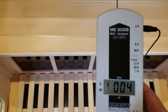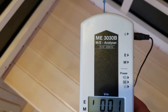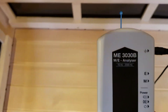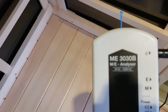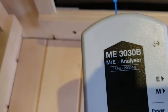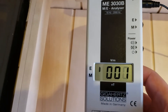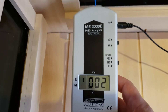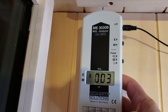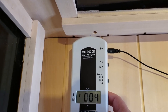People often ask whether heaters are low in both EMF magnetic fields and EF electric fields — but of course it's also about all the wiring and connectors involved in the system. We have a little snap-together connector on the back side of the heaters that makes it convenient to remove them if needed. You will get a little blip of electric field there — looking at that connector area, it's about four volts per meter.